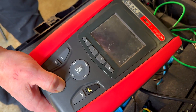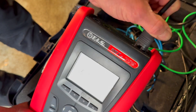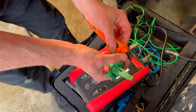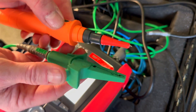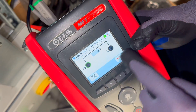Now we're going to fire up our MFT Pro — press and hold the button, it comes on — inserting our leads appropriately into the top of the machine. But remember, we're looking at things like GS38, so look at the tip of the probe: it doesn't want to be any greater than 4mm. This probe is considerably less. So remember to choose the correct test equipment and test leads. Now press our loop impedance test — it just confirms the leads that we need.